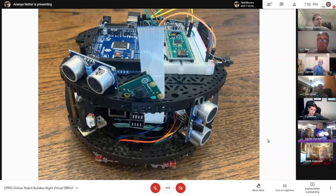I tried disconnecting either VCC or ground, just one. The OLED was still on because it was still getting enough power through the I2C lines. It lit itself up. Oh, that sucks. So I'd have to play with it more to see if I could get away with just disconnecting either VCC or ground and controlling it through a GPIO line. There might be a way to do it. I haven't tried enough, but the bottom line is you've got to have stuff that you can explicitly reset. Otherwise you can get yourself into a pickle.